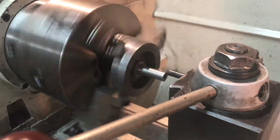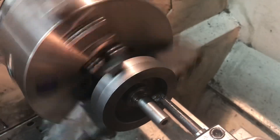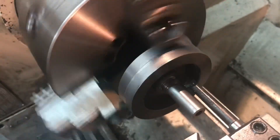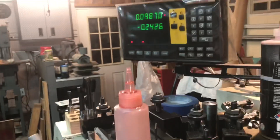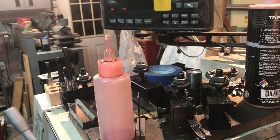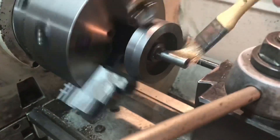I finally got the lathe to run in reverse - I basically had to repair the switch. So I'm cutting down now. I'm machining down, turning down the center stud to a half-inch diameter for the entire quarter-inch length inside from the bottom of the rotating base. I set the Z axis at zero with the tool just touching, so I'm going down to 0.25. I have about 98 thousandths to turn off. After I finish getting it all down to the half-inch diameter, I'll set the angle and start cutting the cone.